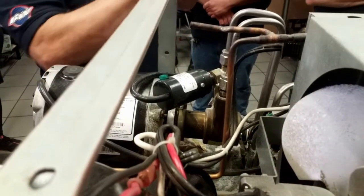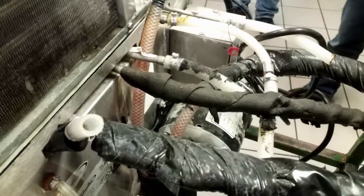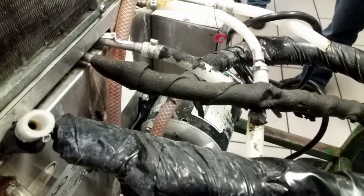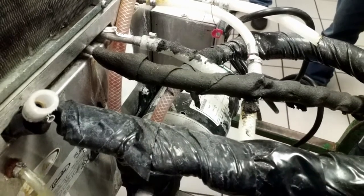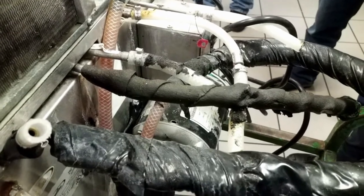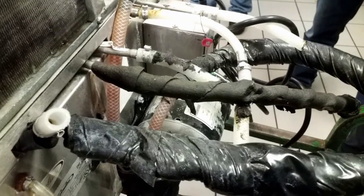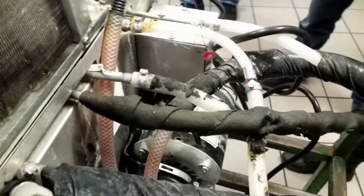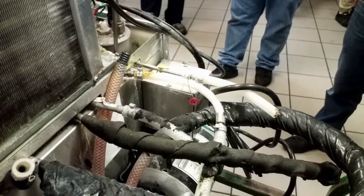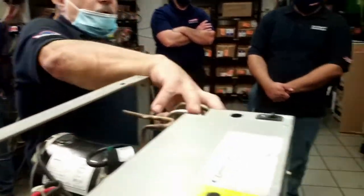As it fills up and shuts off, this circulator pump right here is constantly circulating that cold carbonated water up and back. The only way it's being dispensed, what's pushing it out, is CO2 pressure. When you open that valve, it's that CO2 pressure that's actually coming out the valve. You've probably all gone to the fountain and pushed the lever and it's just CO2. That's all it is.